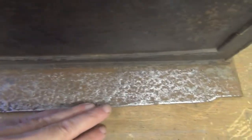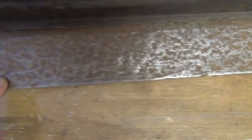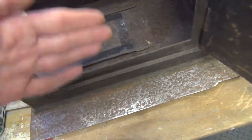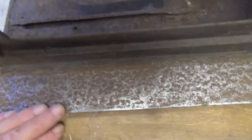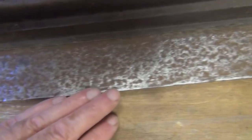I've been scraping the rust from the base plate. It's very heavily pitted, as you can see, and I won't be removing that pitting because it's part of the story. When this had an electric carbon arc in it, you'd be changing the carbons between reels — red hot carbons fizzing and popping — and with your pliers you'd probably be dropping them occasionally, maybe even deliberately onto the base before they went into a sandbox. That's why it's so heavily pitted there. I'll leave that; it will be painted over after the rust has been fixed with rust converter, otherwise it would go completely flat, which wouldn't be right.